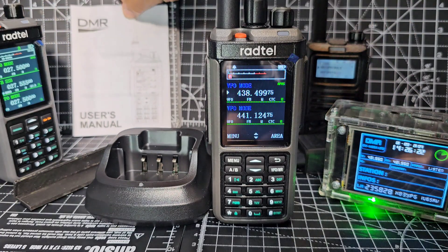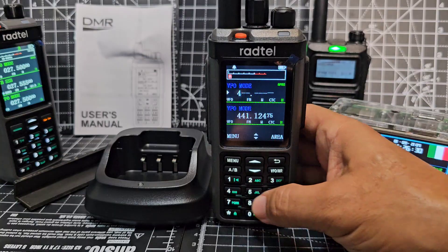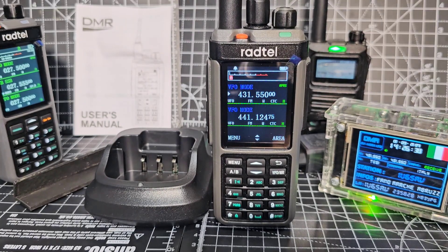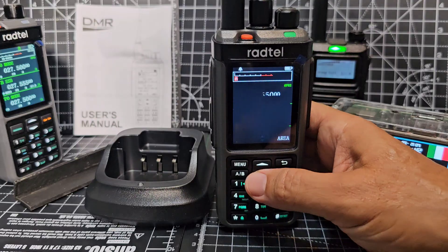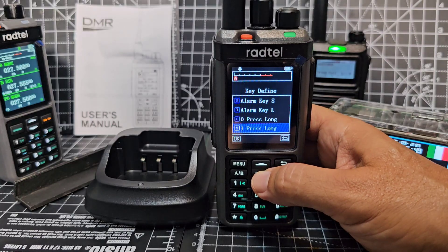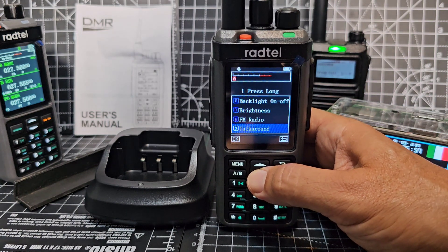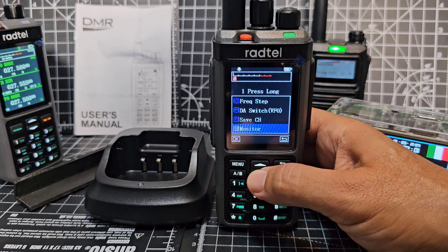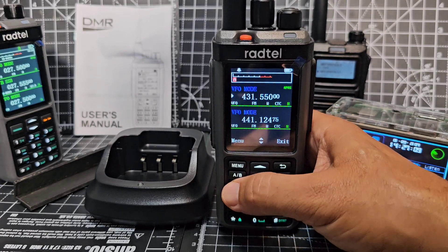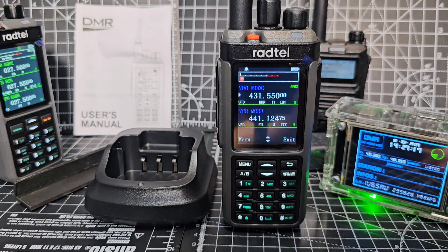Let's get the instructions. I'm just going to type in the frequency of my hotspot now, but we're not in DMR mode - it actually says FM mode there. So we're going to go 431550. I'm not sure if it will pick up any DMR audio because I haven't put in my DMR number yet. On the menu, go to key functions, select. The buttons feel nice, soft, good quality. I can make it do digital/analog by going down. DA switch, select. Now if I press and hold the one, it switches to digital mode.